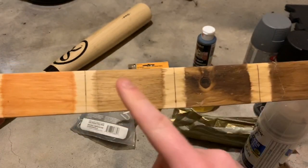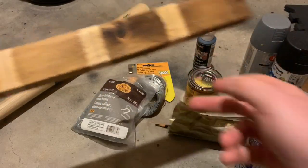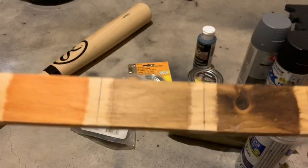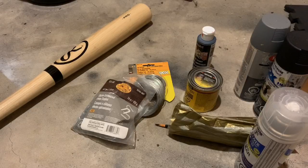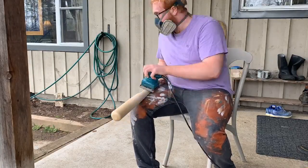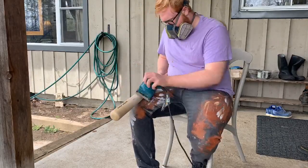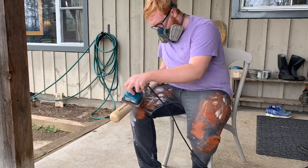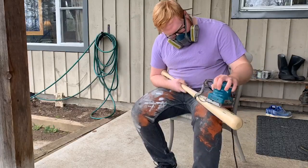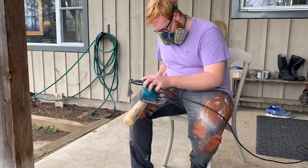I think I'm going to go with the middle one here in Special Walnut, which is this stain here, and I think that will be the best for the bat. In this clip I'm basically just sanding off the shine from the bat. I'm using a palm sander and you kind of have to press a little hard, but eventually you'll get that shine off. Always remember to wear some face protection — it helps so much so you don't breathe any dust.